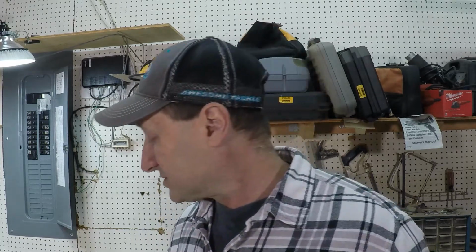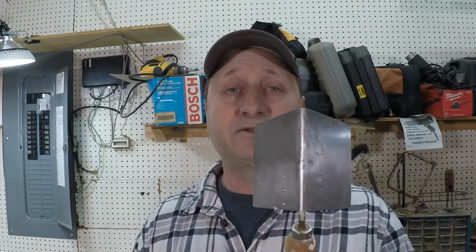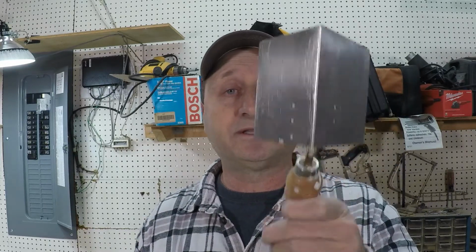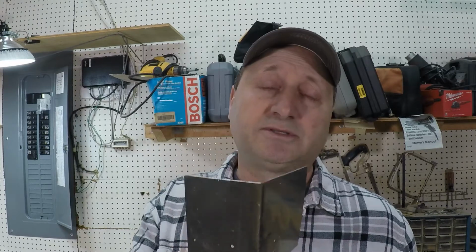And also, if you have any other imperfections in the wall, this is stiff and you can knock the pieces off, so that way you can come back over it to make it look smooth again afterwards. Now, these two things here are not commonly used, and if they are used, they're typically used by beginners that are not as comfortable doing inside and outside corners with a joint or tape knife. But this would be an inside corner tool and an outside corner tool where you could lay in the mud needed and also press it out once you've put your paper tape inside the corner. Use this tool to evenly push out the mud that's behind the tape.